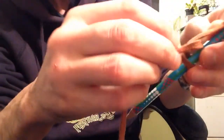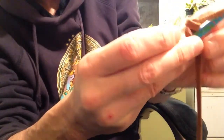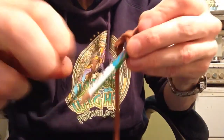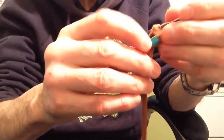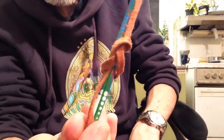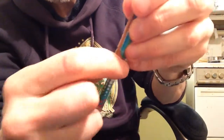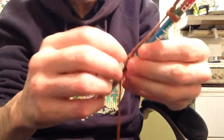After the double wrap around the cable, you come across and under the loop on the same side. I'll show you this a couple of times as it's not easy to demonstrate on camera. If I slack it off you can see the basic figure-eight configuration, but this time you've looped around the tie coming down — so when you tighten it up you've got a nice cable tie.